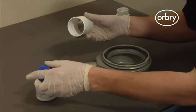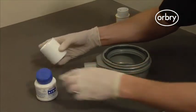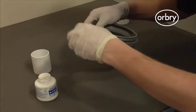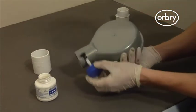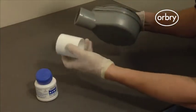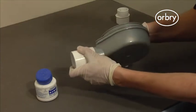Now you are ready to install the waste pipe and trap. The waste trap and fittings are all Solvent Weld products. It is important to properly clean all pipes and drainage parts using the appropriate solvent waste pipe cleaner, as they must be cleaned prior to connection of all of the fittings. After cleaning, apply the Solvent Weld adhesive.